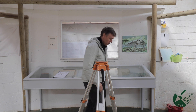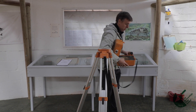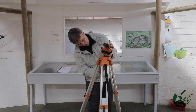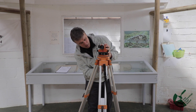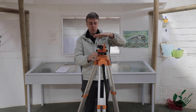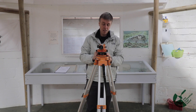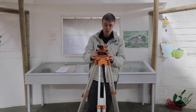When you're happy with your tripod, you move to the second piece of equipment: the level head. When it's been put back in the box from previous use, the feet should have been reduced so the level is fully extended down. You get your level, ensure the feet are in their bottom position, and clamp it in with the clip on the bottom. Then you move two feet at a time to get the level head perfectly level — there's a little spirit bubble, and you keep moving the feet until the bubble comes into the center of the circular target.